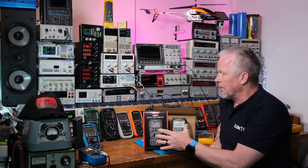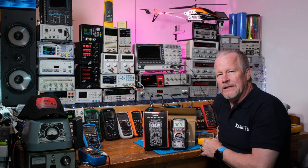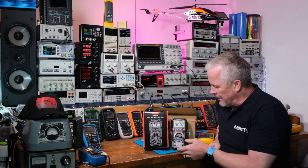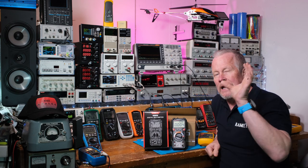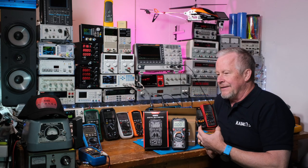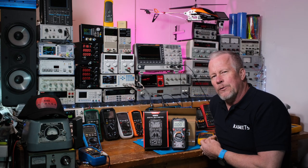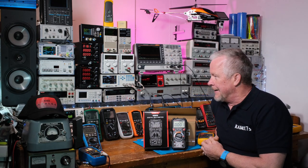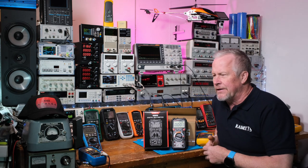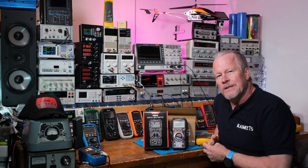These are self-certified but lower cost meters - that's what you're often going to find. You'll find a CE mark, which is a self-certification. That certification gives you confidence when you're category three - an electrician working on lighting, on the other side of 15 amp breaker panels - places where there's more energy and more potential for transients. In a bench area like this, category one or category two, you don't have that issue. Category four, when you're on the other side of the meter outside your building, is very scary stuff - you're wearing gloves, all this protective gear.